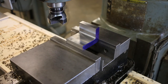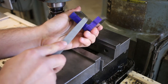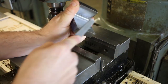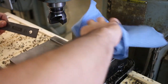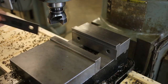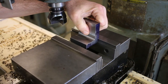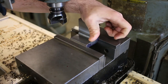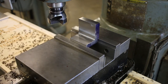Get all this cleaned up. Back the part off. Remember you've got these big burrs right here, so let's get those off as well. Make sure it's nice and clean in here. Now it's time to do the other side. Close the vise jaws down on there and remember we're going to have to repeat all those steps again to finish the second side, so we need to inspect it for the hole being out of squareness with the table.